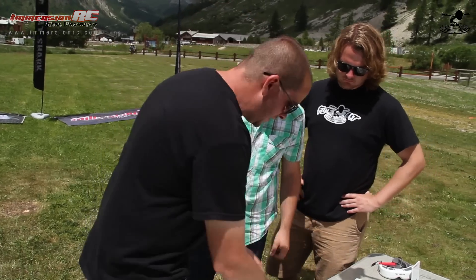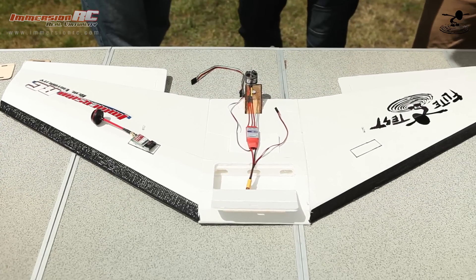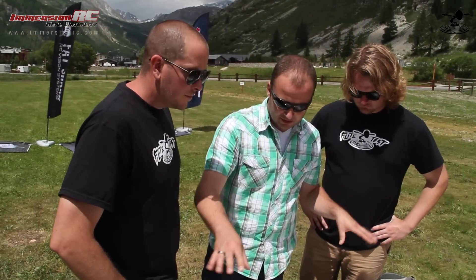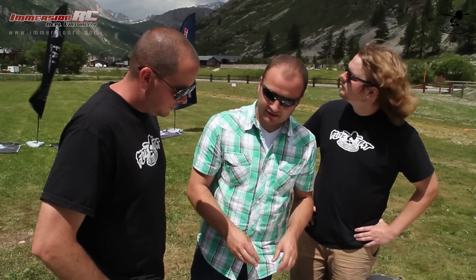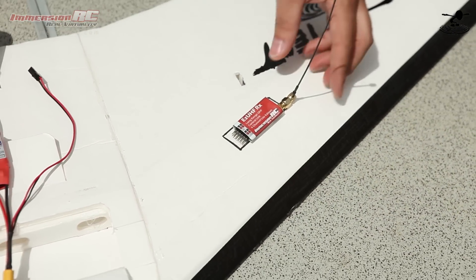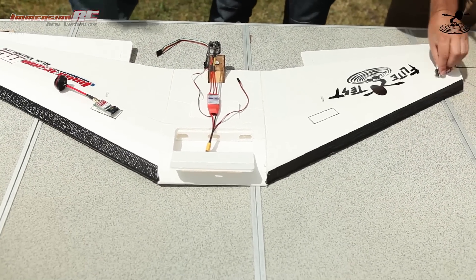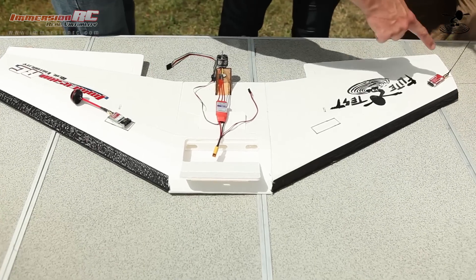So what are the main components? You've got your RC setup and your receiver. There's something special you do with your receiver so you don't have all this wire and energy transferring all over your wing, muddying up your RC link and FPV link. Especially on larger builds with longer wire runs, you want to look at how power is distributed. If the ESC is out on the wing, cables become excessively long to control a servo on the other side, and the power has to travel all the way over there.